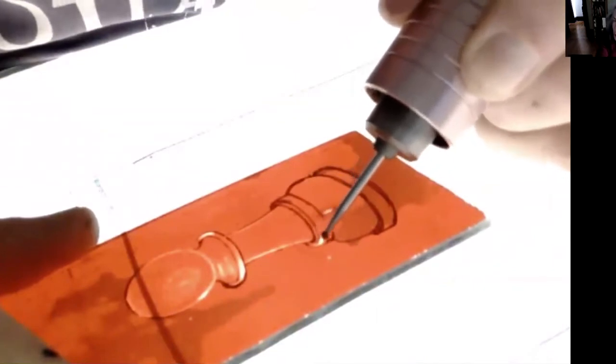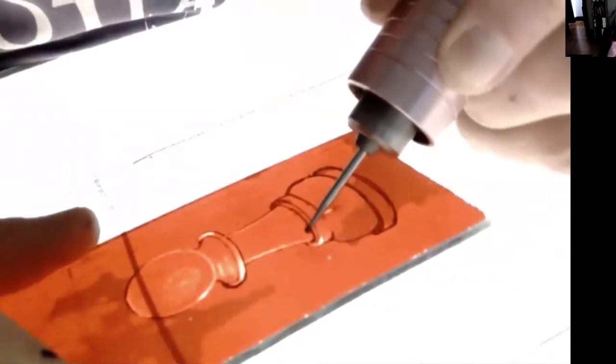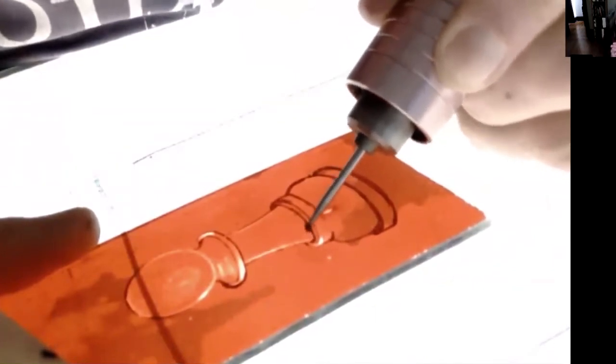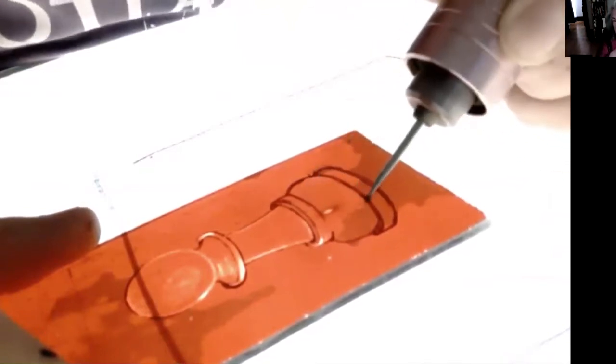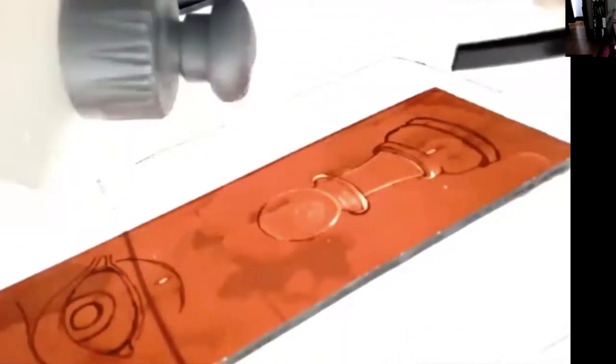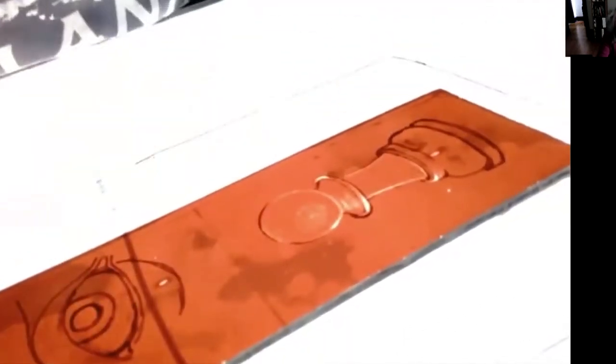It's glass slurry. And the glass slurry creates a barrier between the diamond surface and the glass, so that you're less effective using your tool. Also, without the water, the tool will last, oh, I don't know, an hour or so before it will go bald. So the water is very necessary for all diamond tools. And there I am, cleaning up the water again.